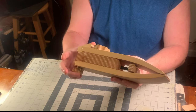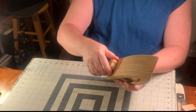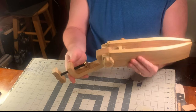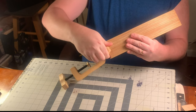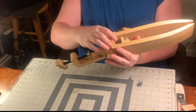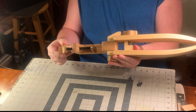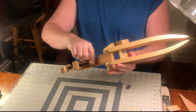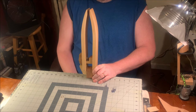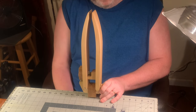It's very simple to use and I like the small form factor. You've got a small knob and a large knob — the large knob adjusts your jaws to open them up and fold the unit out. The small knob adjusts the tension for the lower part that attaches to your table. When mounting, rotate it up slightly and if you're doing this on wood, put a piece of leather down so it doesn't mar your table. Just give it a few turns — you don't need it super tight, just snug.